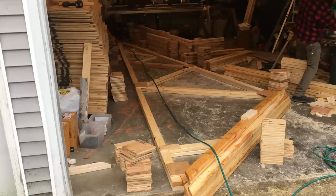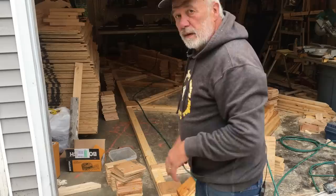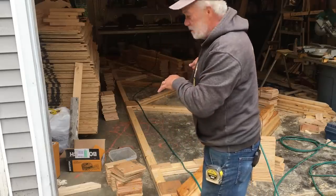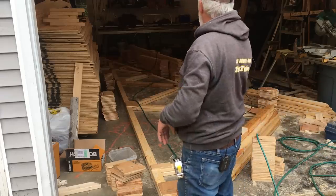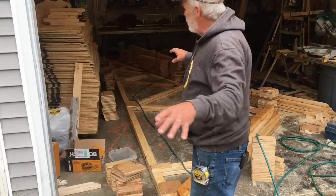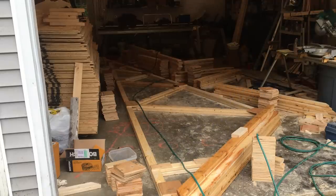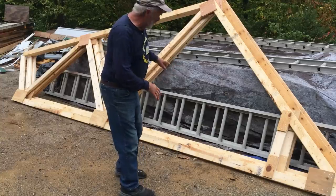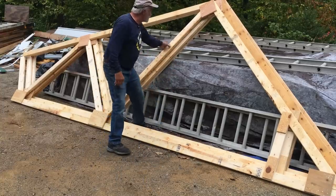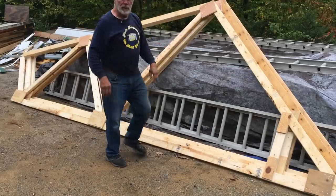Making sure that these line up with the bottom template truss. The truss is all built on one side. We're going to split it into two — we'll take one section out here and use it as a template, and use the other one in here as a template, so that we can spread out the work. Half of a truss here — we'll be putting gussets on both sides for strength. The two gable ends we'll make with verticals for sheathing nailing.